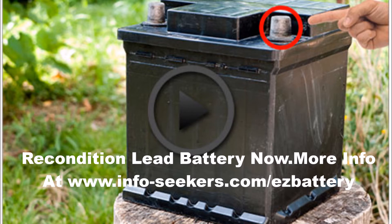Why is an equalizing charge needed? An equalizing charge is needed because lead acid batteries have sulfation issues that prevent proper charging. Sulfation takes place because small sulfate crystals form when a lead acid battery is in use. This is normal and not harmful. However, when the battery is only partially charged for a prolonged period, these sulfate crystals turn into stable crystalline and build up on the battery's negative plates, which prevents the battery from taking on a full charge.